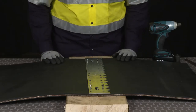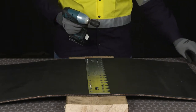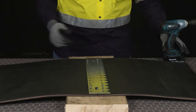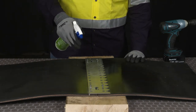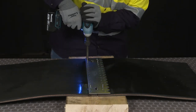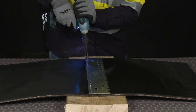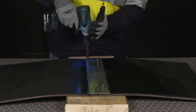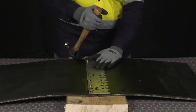Next, we're going to punch the holes into the belt. We're going to use our half-inch impact and install our quick change chuck and the corresponding power punch for the fastener size selected. It's always good to apply silicone to the template, which helps cool the power punch. When punching the belt, we want to make sure you don't go too far into the wood, or else that'll dull the punch quicker. After punching the holes, we're going to remove the nails of the template